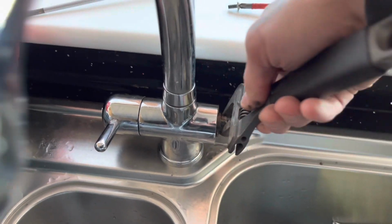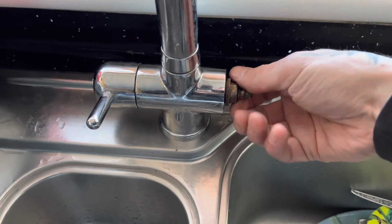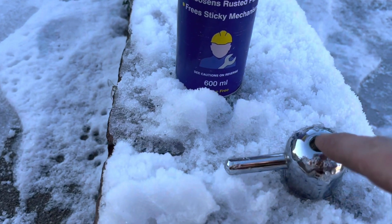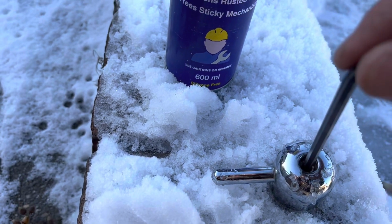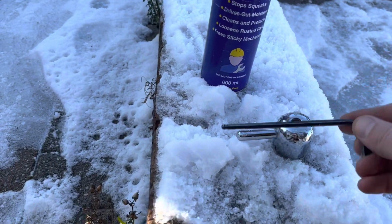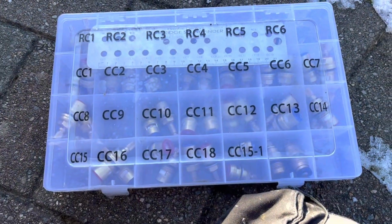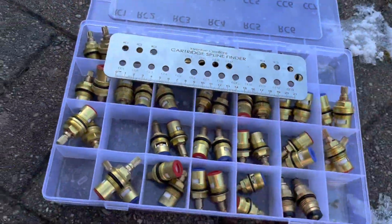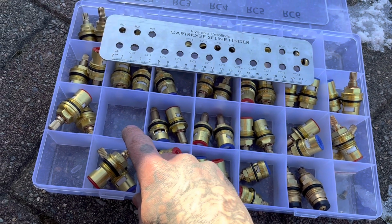Undo the actual cartridge out of the body of the tap. That's what we're going to be replacing. So we're going to have to soak. I've just put some WD-40 on that, trying to soak that. I'm not going to punch it, so we're going to use an Allen key and just try and tap it out. I should be sponsored by WD-40, really. And hopefully, with this tap kit, four different new cartridges in. Except that one, which I need to replace. Sounds like it's going to be that one.